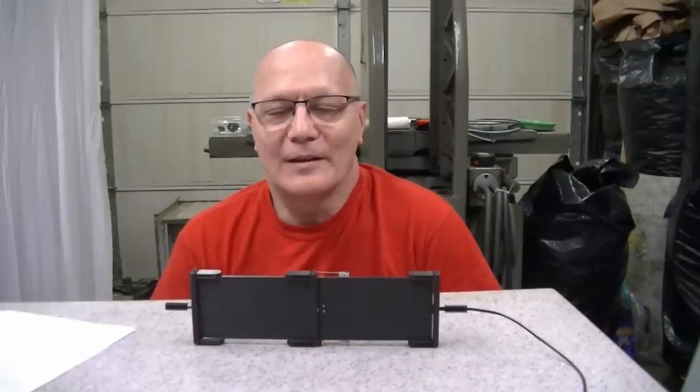What will I use such a large plate for? There's no such thing as too big a plate — as soon as you think a plate is big enough, you get something bigger with parts overhanging. The Mitsui rebuild behind me will use this plate: I'm going to put the reciprocating table part and the entire saddle on here separately to do checks on the scraping, straightness, twist, and all those things. This plate is by no stretch too big for what I need.